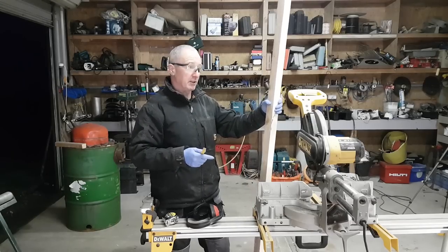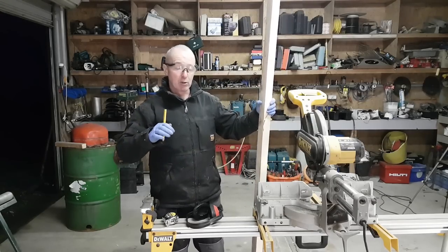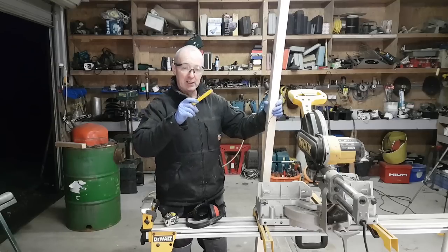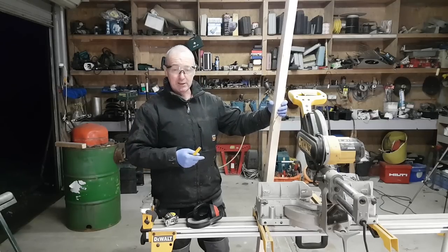You can make them any thickness you want or make it out of anything you want. Literally, I'm knocking this up out of what I have in the shed today, and I want to use it in the morning. I want it to be strong. I don't want, when I get on it, to be on the ground again. So the plan is to notch the rails and put the rungs into it and then put screws through that. So it'll be nice and strong.